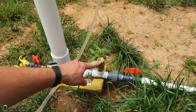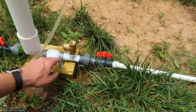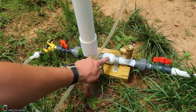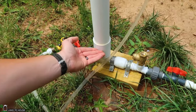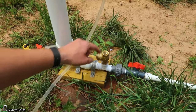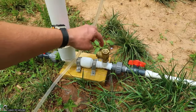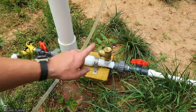The pump has two check valves and a pressure tank. This is called the waste valve — it's the same size as the drive pipe, in this example half-inch. Then I have a secondary valve which is inline, and next is a pressure tank. To start the pump, I need to just push the waste valve down until it builds pressure in the pressure tank.